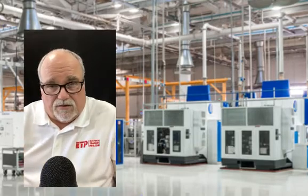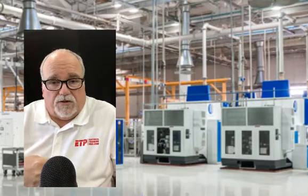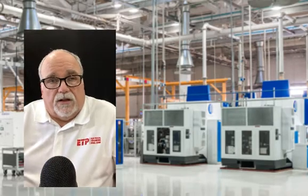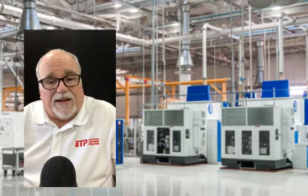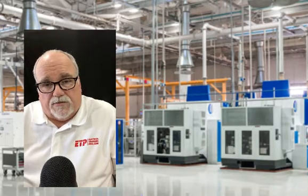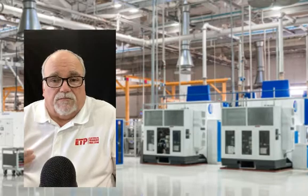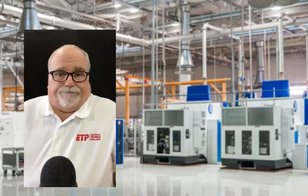So think about this. You had to walk past the control panel, open the door, which then hit the other machine. In an emergency, you couldn't run that direction because the panel door had that whole area between the two machines closed off. If you're in an arc flash event, two things likely will happen: you will be deafened by the loud sound, and you'll be blinded by the bright light. Picture yourself back in there between these two machines, and an arc flash occurs. You get blinded and deafened — how are you going to get out of there? You may know what direction you need to go, but you run into that open panel door that's stuck against the protrusion on the other machine.